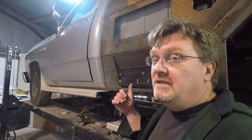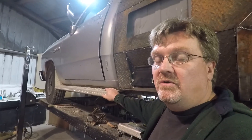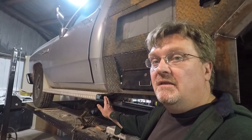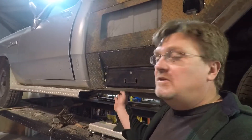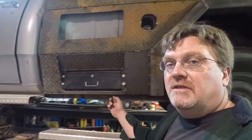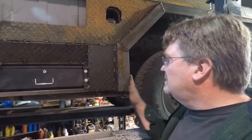I find that I'm always loading things to the side of the truck, so I want steps to make it easier. I bought some, but they were for a crew cab truck, so they're way too long. That's okay because I cut the ends off the extra length — I'm going to use that behind the rear wheel so I have some extra length there. I'm going to mount the piece to the area between the cab and the wheel in the rear, and attach it to this member down here — 1x1 tubing, which will be plenty strong. Then I have this 1x3 where I've made the fender.